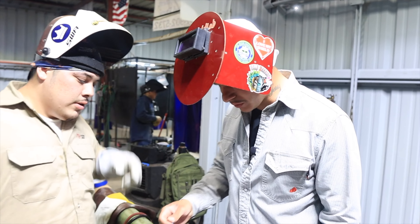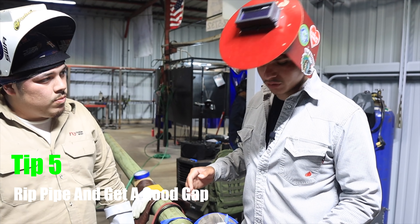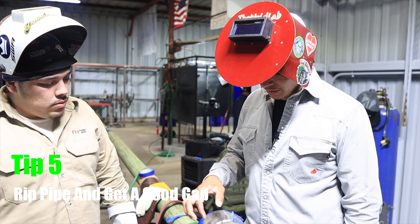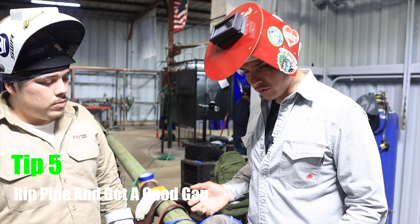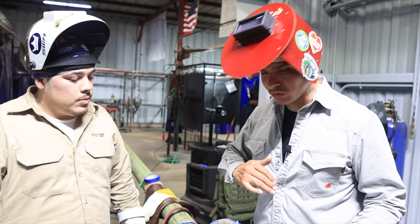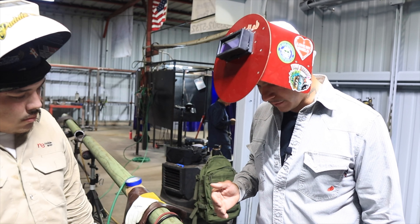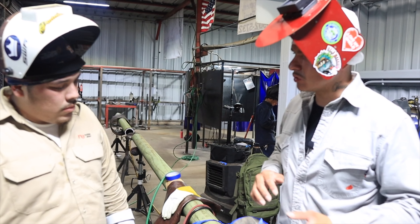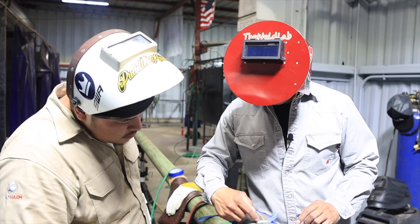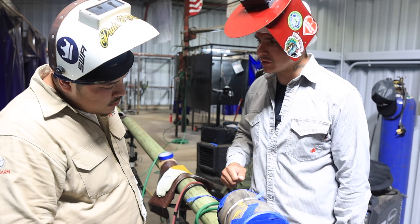He's doing his root and whenever you do stainless it closes up, so you have two options: you can rip it — get a 1A disc, cut into it, make your gap bigger, and back feed — or you can keyhole dip. Personally, if you're just learning, I think it's better to just rip it to keep the same rhythm. I don't like the keyhole dip that much. So what I want you to do is rip it to about halfway, cut your tack out, rebevel it, and finish it out. Let's see how it looks.